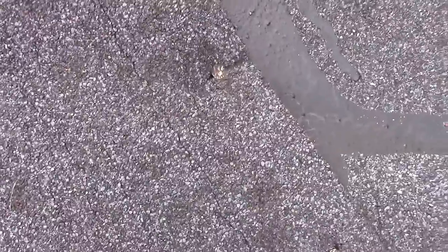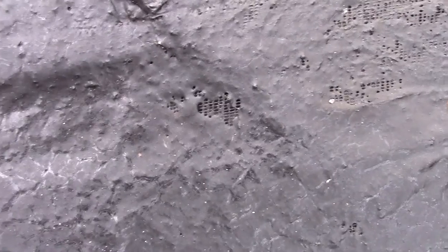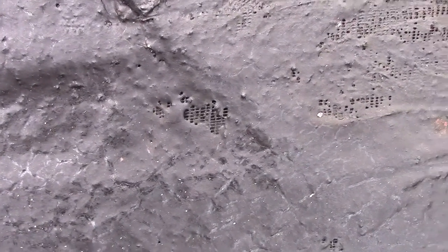I think I found the leak right there. I had the wife up here helping me — she was tacking this down to help me spread it, but she went right through that one, and the other one she broke. There's nothing there to seal it, so the water's going to come down inside on the inner roof and drip right about here. That's probably it, or right there — just a little piece of mesh with no tar under it, and that would cause the problem.